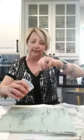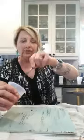Another thing you should do is periodically give it a stir, because the milk paint powder has all of these pieces of paint pigment. Even in a light color like this, the Just Ducky, you might see a little bit of cobalt blue and a canary yellow in there. You want to make sure you mix that up. Otherwise, you may end up finding a cobalt blue streak or a really bright green piece. Kind of looks cool to me, but to each their own.